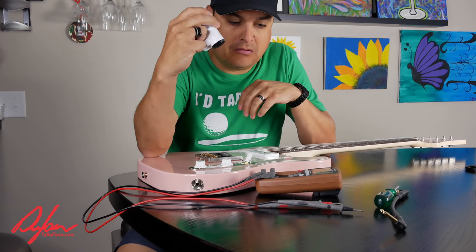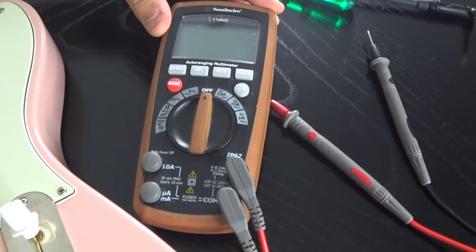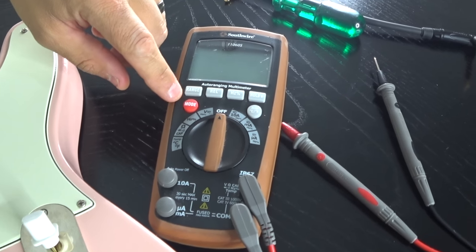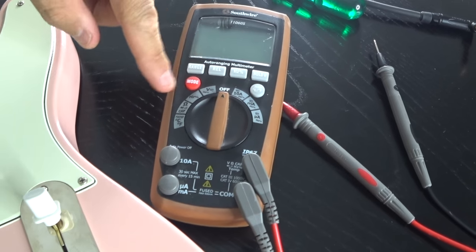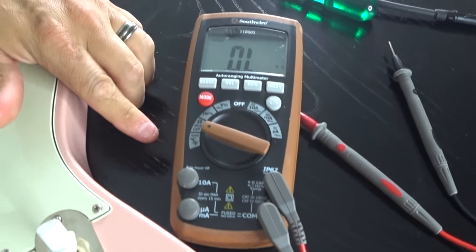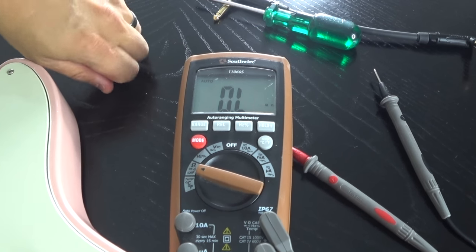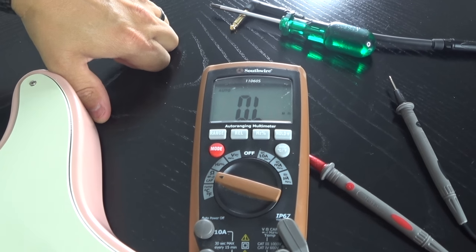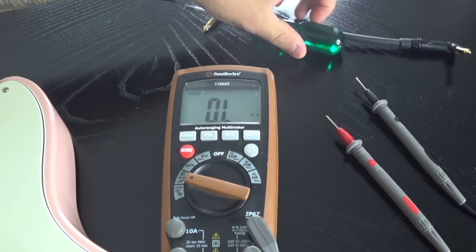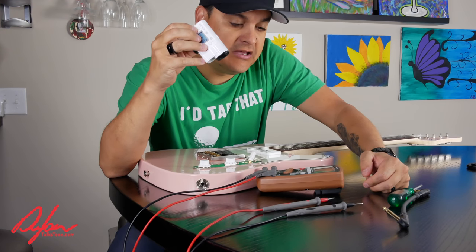We'll go to Baby Cam and I'll show you what I'm talking about. So let's look at the basic multimeter — just a simple, inexpensive multimeter you can buy pretty much anywhere. We'll throw a link to a couple of them in the description. Basically, we're looking at voltage, frequency, temperature — a bunch of stuff that doesn't really matter for what we're doing. I basically like to use the auto-ranging resistance measurement. That little symbol that looks like a mushroom is the symbol for ohms. On the screen it says O-L, which just means that it's open — the probes are not touching anything.